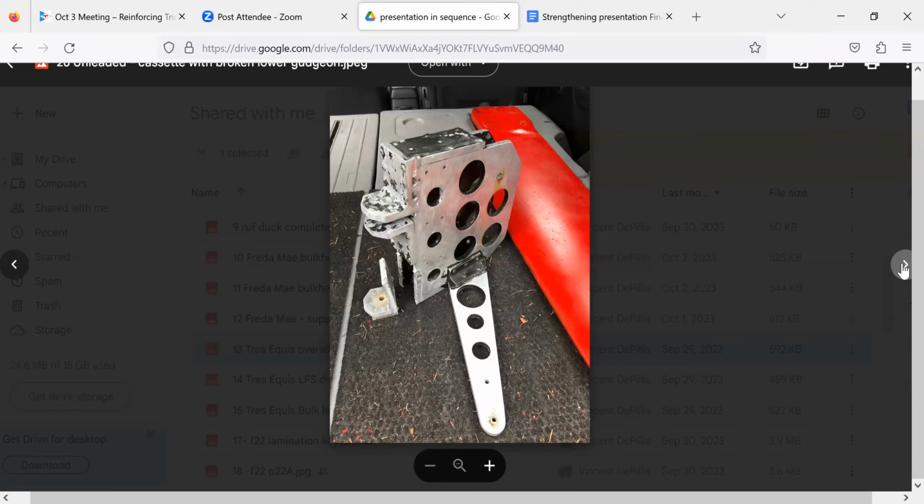Is there logic to having a daggerboard that's just more fragile? Yes, absolutely. I think the other thing is the centerboard. Yeah, well, the centerboards are great. Knowing what I know now, centerboards are great. Whatever, slot turbulence, I don't care. Some people design daggerboards with kind of a cheap part that can just knock off. Yeah, the weaker it is. Yes, absolutely. I think that assumes that you're only hitting on your last one third or one fourth. It would make sense to me. And also in the head, why not have a very soft foam at the top of the head, so that it would crush? Something like that can absorb that. Yeah, exactly.